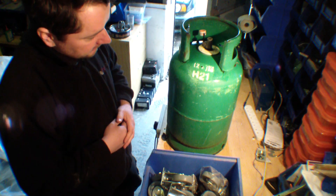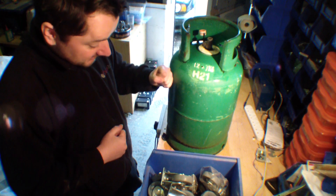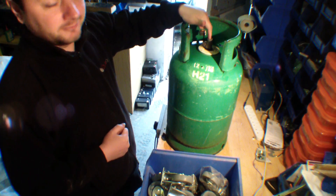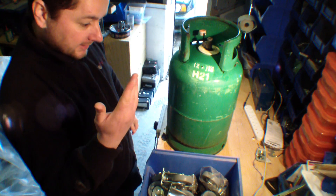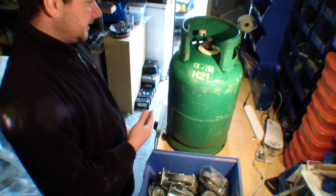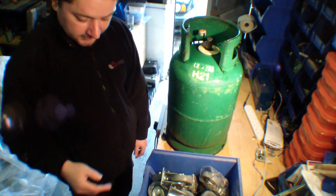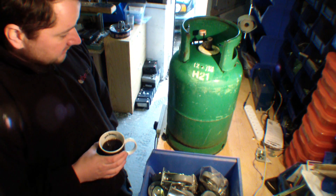If you don't know what you're doing, don't try this at home. Make sure you get an empty bottle. Leave it overnight, two, three days with the tap open. Then carefully drill a hole. Leave it a few more days if you want — just be sure. Basically make sure there's no gas in it. You don't want to be grinding holes in it when there's gas in it, because it will go bang in a very nasty fashion.